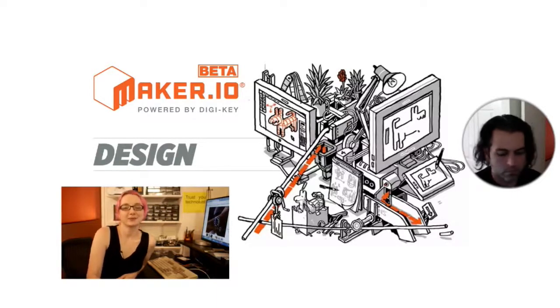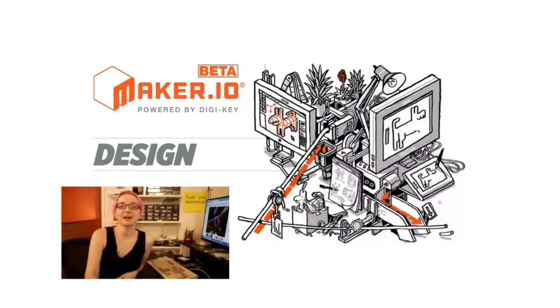Good question, Floating Philhead. In design, every step is a bridge between the previous and the next step. The previous step to design was where we set up our bill of materials and decided what the pricing was and what our requirements were. And then in design, we actually spec'd out parts. We played around on the DigiKey website and found the lowest cost thermistor, found a good temperature sensor, found a three-axis accelerometer.